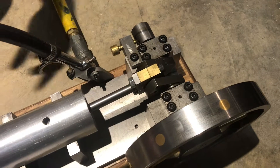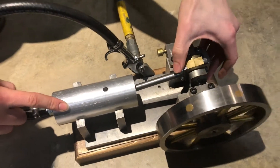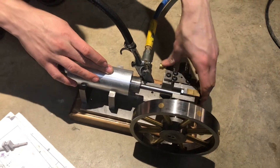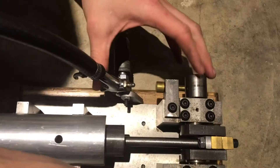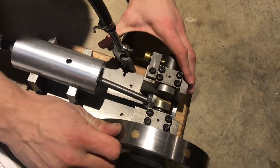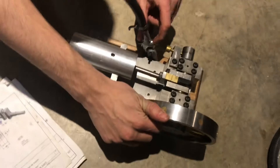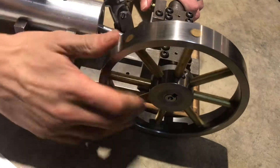When it's triggered it feeds air into the cylinder, pushing the piston back all the way past this hole — that's where the air vents or escapes. By the time it gets to that point, this brass piece is no longer forward so the trigger is not pressed anymore. That gives the piston time to return back to its original position so it can press back on the trigger. The flywheel gives it the momentum to carry it back on the backstroke.